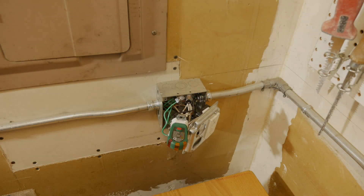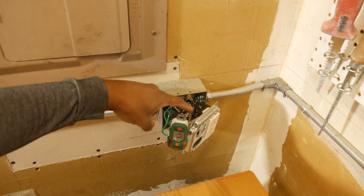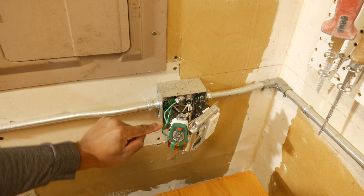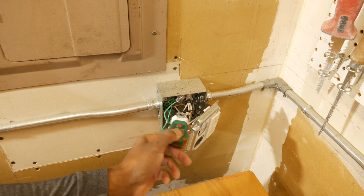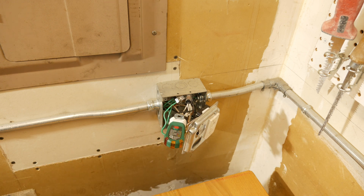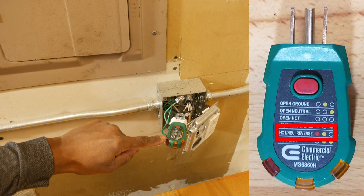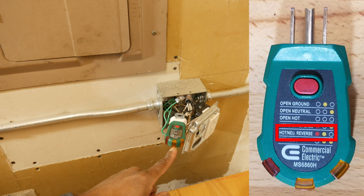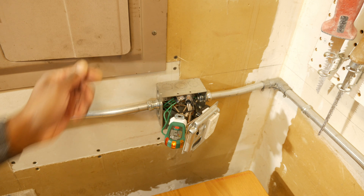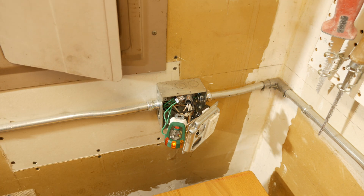In this instance I have the black wire and the neutral wire reversed. Typically, the white wire is hooked to the silver screw and the black wire is hooked to the gold screw — here they are swapped. I'll flip on the power, and what we should see is the red light and the yellow light come on. The power is on, and the outlet tester correctly told us that our hot and neutral are reversed.